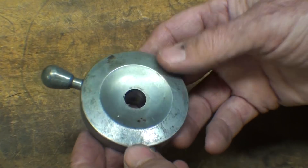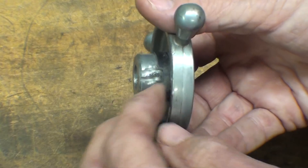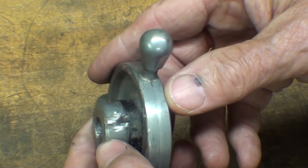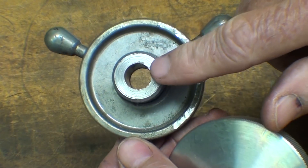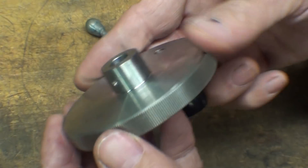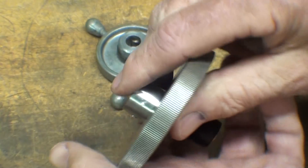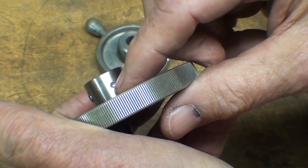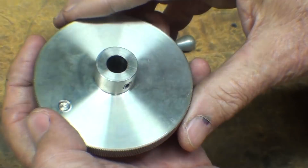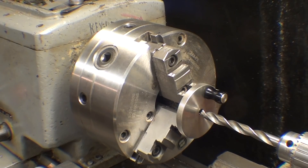Once the pin was backed out, the wheel slipped right off. This drill press has received very little use over the years. The new crank has a half-inch hole needed, while the current hole is 3/8 inch — so I'm going to put it in the lathe and drill it, then ream it to half-inch. This is steel. When you do something like that, note there is a set screw here with a small dimple. Back out your hardened set screw so it doesn't damage the drill and the reamer. Thank you, Mark Brozak, for this nice crank.